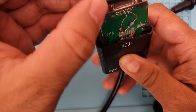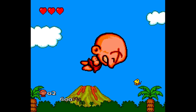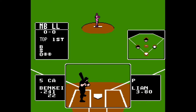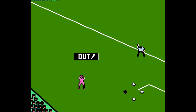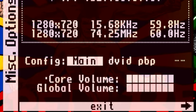With the mod complete, I'll close up the PCB and then start editing the MiSTer INI file for the needed settings. Before you set up the INI file, keep in mind that MiSTer is an ongoing project and INI settings might change in the future. I'll provide a link to the direct video documentation so you can get the latest INI settings. I also highly suggest that you copy your current INI into a new INI preset to back it up. Since direct video will be the main way we use the MiSTer FPGA, we want the main INI profile to contain the direct video settings. You back up your current INI file by making a copy, then rename it to MiSTer_[four-letter word].ini. The profile will then appear in the miscellaneous options screen of the MiSTer FPGA when you reboot, named after the four-letter word you chose.